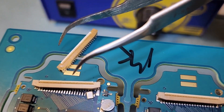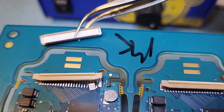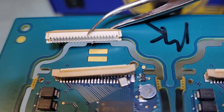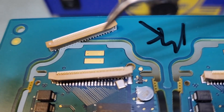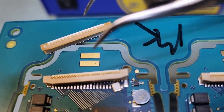I just wanted to show you this — this is the ZIF clip at the bottom of it. That's what we're going to be replacing — I mean, putting back on pad. Pretty easy. But the thing is, these things are very susceptible to heat. Touch them with a soldering iron or too much hot air on them and they will melt pretty easily.